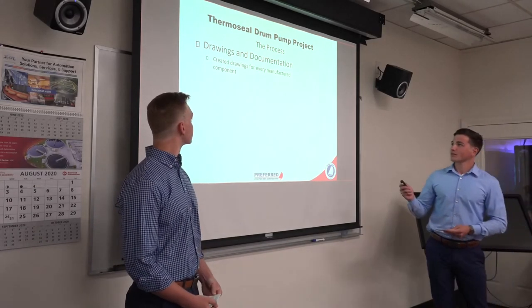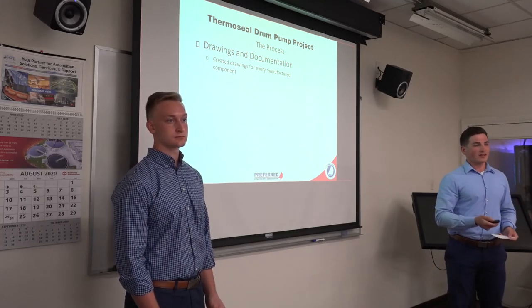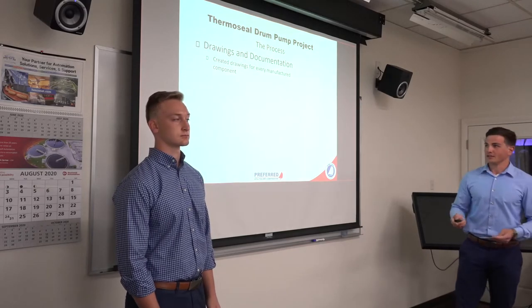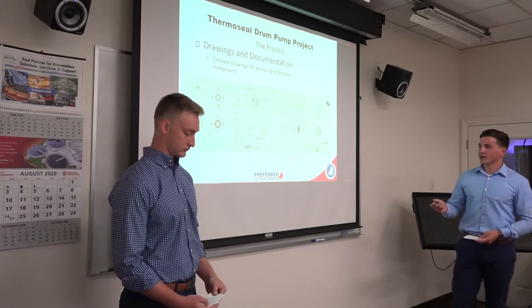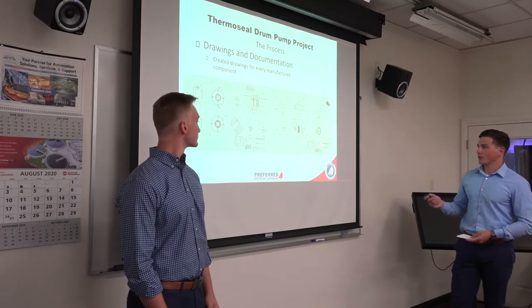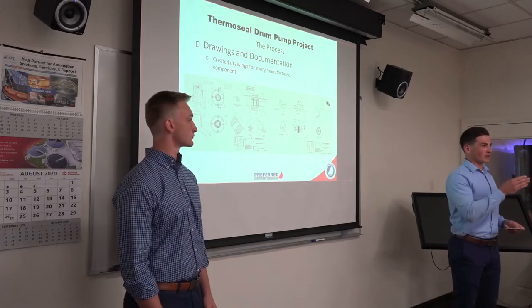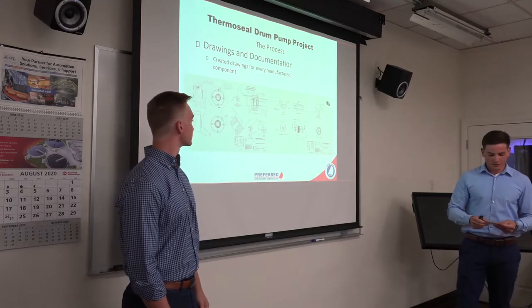And again, every single component that we designed, we made from scratch. Everything that we did, the whole thought process, the different tolerances, the names for the seals, everything concerning each component, we made drawings for every single one of those parts. Here's an example of what that looks like. You have a piece from the portioner here and a piece from the drum pump here. And this includes all the tolerances specified in the handbook. We went through with a fine tooth comb and made sure everything was down to a T.